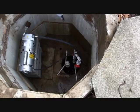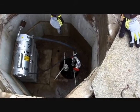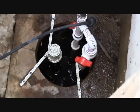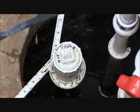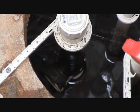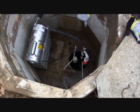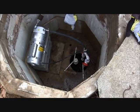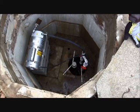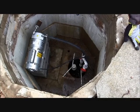The return line — the smaller line — feeds air directly to the bottom of the tank. The discharge point for the return line appears to be coming up out of the water, but this line actually goes to the bottom of the tank, is angled toward the clarifier, and is designed to pick waste off the bottom, returning it to the top for continued treatment and circulation. Note that the air lines for both the primary diffuser, the return line, and the discharge for the return line are properly anchored to the tank top. As they receive pressure, these lines may move, and these anchors prevent oscillation and damage that may result from movement.